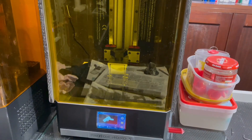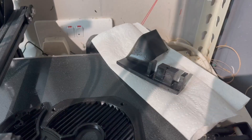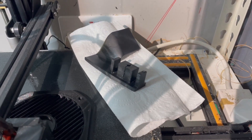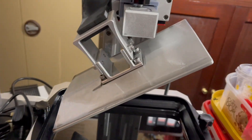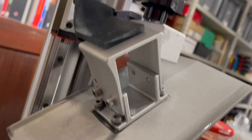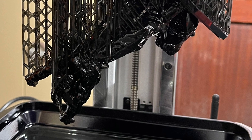I still have a few more tweaks to make to this to make sure it's perfect, but then we'll upload it and put it in the description by the end of the week. Once the part was printed I removed the supports, gave it a wash, and then used the heat from the bed to dry it ready for UV curing, which I've done in this little UV nail box. And there it is — you can see it working its magic, holding the build plate on an angle, which means the resin drains off much quicker and nicer, as shown in this Goku print which has just finished.